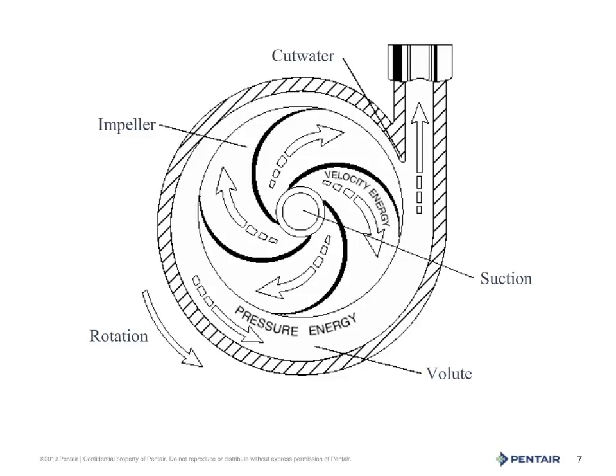So as the water enters the volute case or diffuser at a high velocity and is allowed to slow down by flowing through an opening that is gradually widening, this will cause the velocity to go down, thus the pressure must go up. Remember again, velocity and pressure are opposite relationships in an enclosed system.